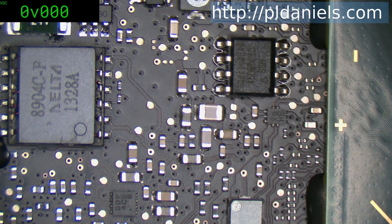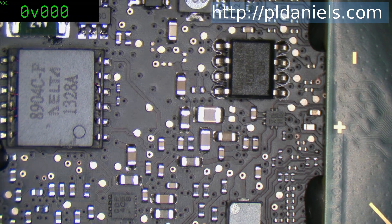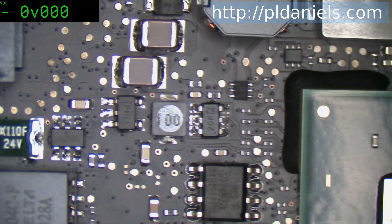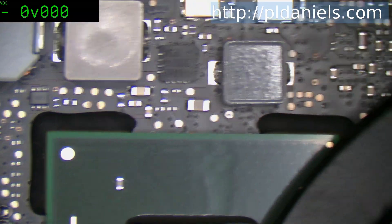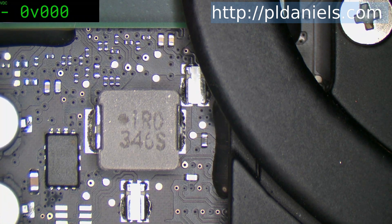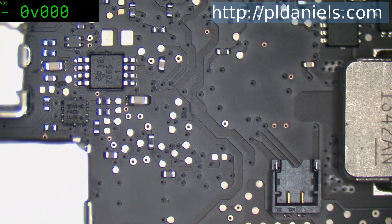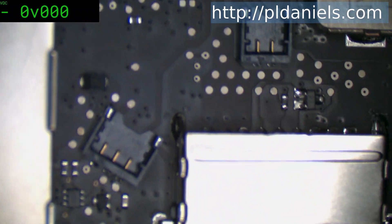Hey everyone, Paul here. I just wanted to demonstrate what a board that's been through an ultrasonic clean in a generic ultrasonic cleaner — four minutes at about 65 centigrade — and then put into a deionized or distilled water wash. I am aware those two things are different, but this is just more to indicate that there's no alcohol involved in this process. It's just straight out of the ultrasonic cleaner, rinsed off in water, and then put into the oven for about 12 to 15 minutes at just a bit over 100 centigrade.